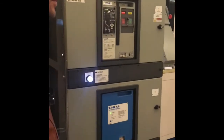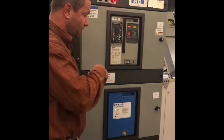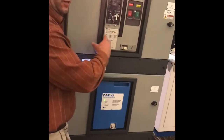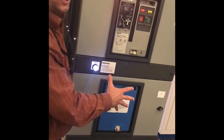There are obviously endless configurations. One of the neat things with MCC applications is you could put one of these downstream of a feeder that's feeding one or multiple MCCs. The sensing equipment could be in the MCCs, communicating back to this device. We can have all this in the switchgear and clear the fault, so your whole MCC is protected by this device.